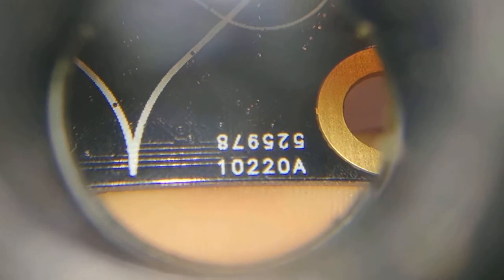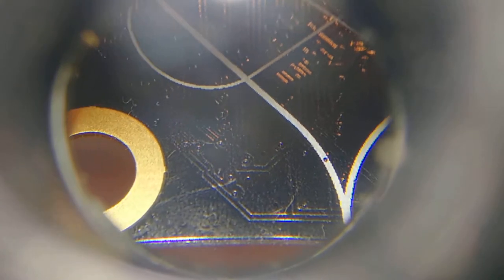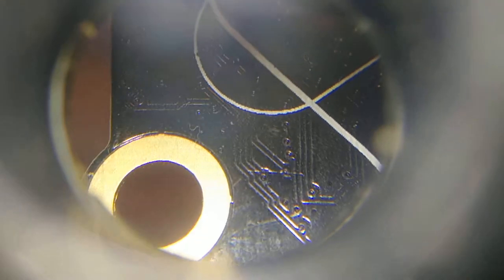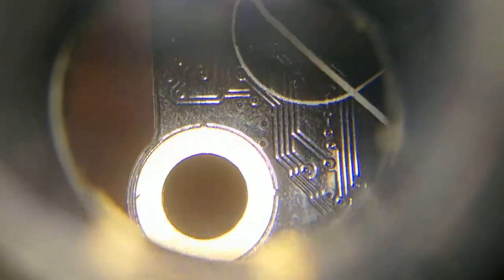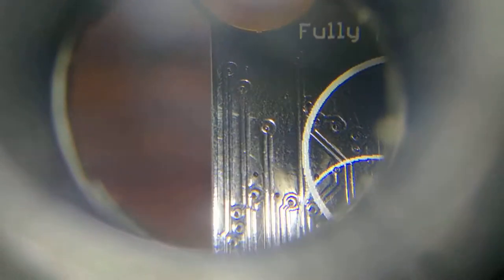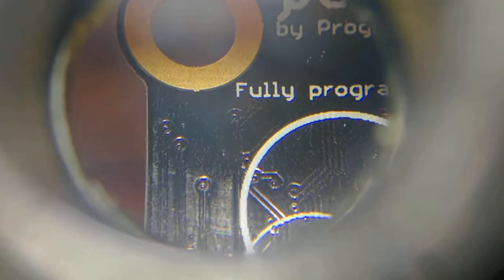For the bottom side, here you can see the tracking number is just here — I found it a bit rude, but I didn't tell them otherwise, so it's okay. On the bottom side you can see, maybe through the solder mask, that the drills are again not perfectly centered with their vias. But the ring is unbroken, so electrically it will work just fine.